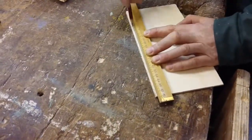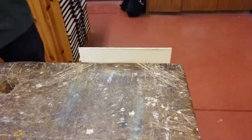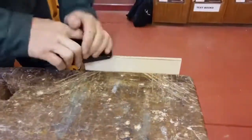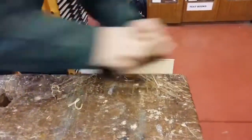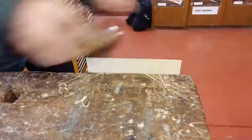You can see here it didn't make it the whole way out to the end so I used the ruler just to extend the line. I'm going to use the block plane to plane this off in the vise. You can see the line very clearly there on it. We'll work our way down to the line and when we get as far as the line that prepares us for the next part of the marking out to fit this top.